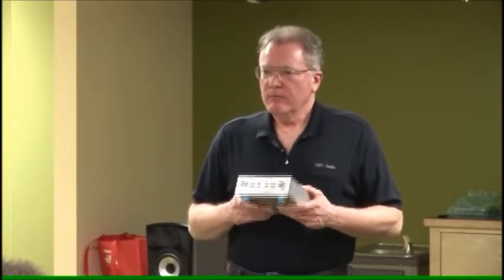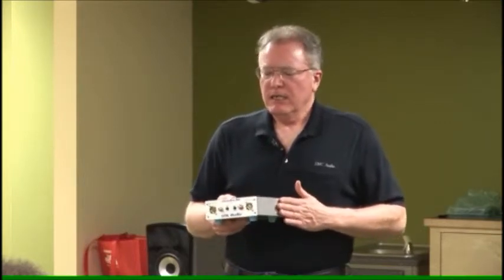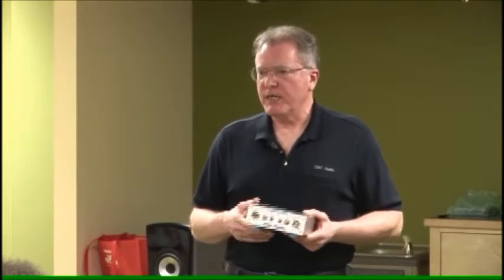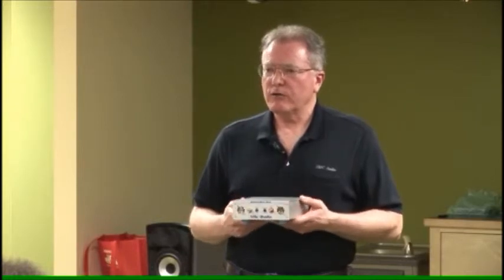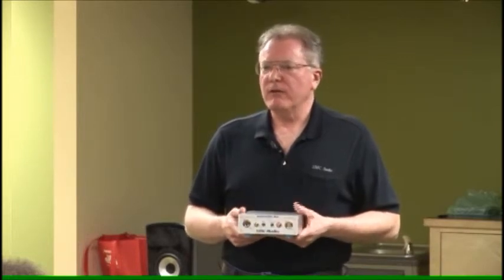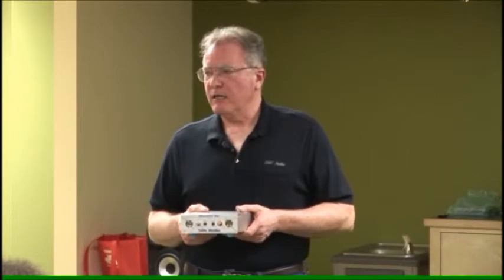This particular box is designed as a 4-to-1 ratio from input to output. That provides a very useful impedance transformation — a fairly high input impedance of about 40k ohms and a fairly low output impedance of about 200 ohms, which can drive pretty much anything including long interconnect cables. That also results in a signal attenuation of about 12 dB, which can be useful if you have so much gain in your system that you can only get the volume control up just a little bit before it's already getting loud. This is a way to transparently reduce that gain while providing these other benefits.